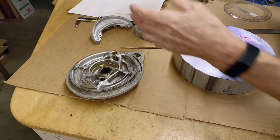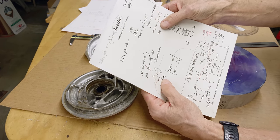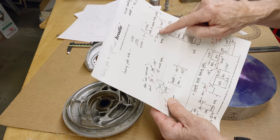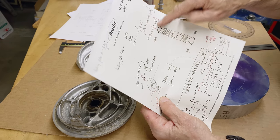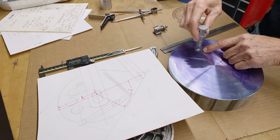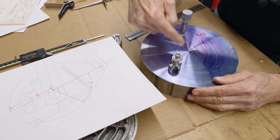So what I came up with — there are my two numbers. I added them up and divided by two: it's 2.202. Now, everything made by the Japanese is always metric. I looked up what was metric and that was slightly under 56 millimeters. 56 millimeters is 2.205, so I was out by 3 thou. I'm pretty sure it's going to be 56. That's the measurement for where we have to drill the holes — that's where the brake arm goes. So we're going to go to the mill now and drill those three holes.